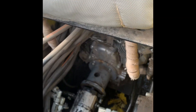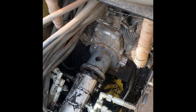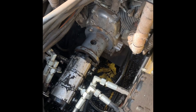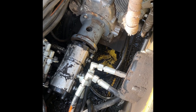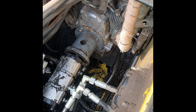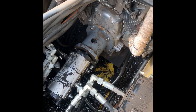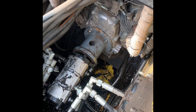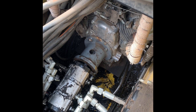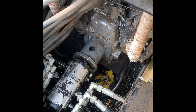After four inches of rain yesterday, I got back at this project. I pulled the spacer collar — I had to get some new bolts because the old ones fell out, so I've now replaced the bolts into the engine block. I have them loose right now; I'm trying to mount this pump back into position, which is being quite a hassle because the spline shaft has to mate up with the output shaft on the engine. I've got the spacer in loosely bolted.